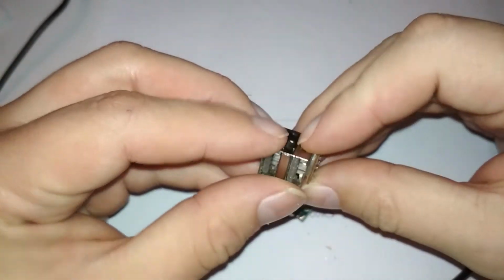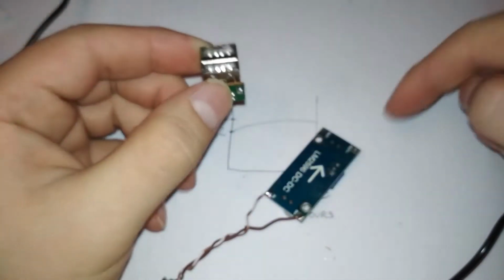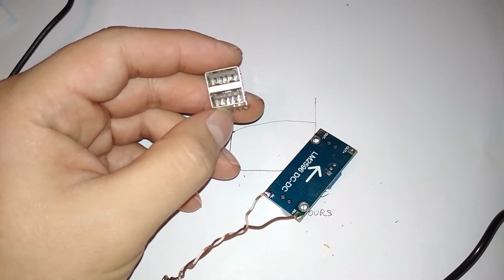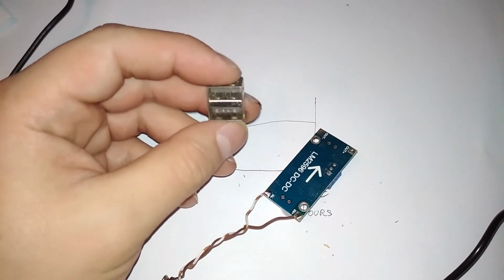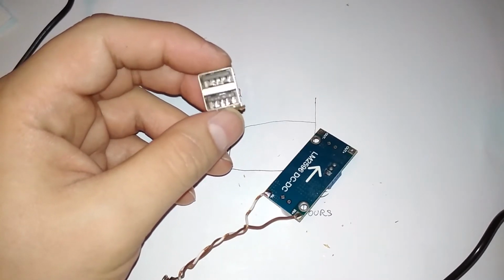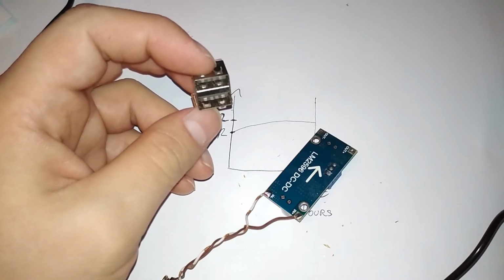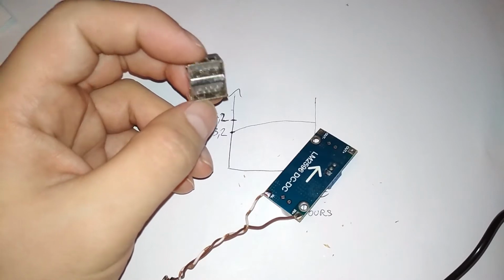Okay. So this will actually output 3 amps total through this DC to DC board. And yeah, I just need a strong power supply for that. For 3 amps with 93% efficiency, I need a 12 volt power supply with at least 1.8 or something amp output. Or 2 amp output, yeah.